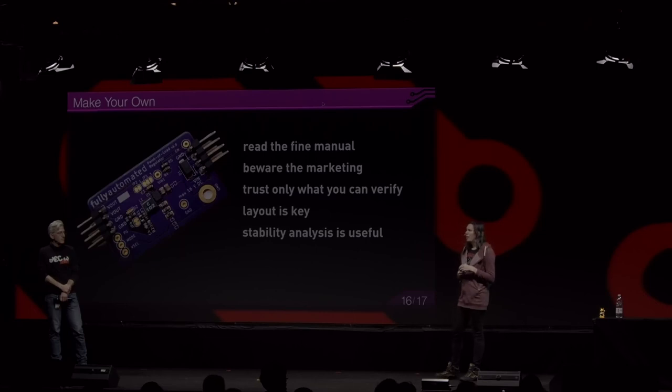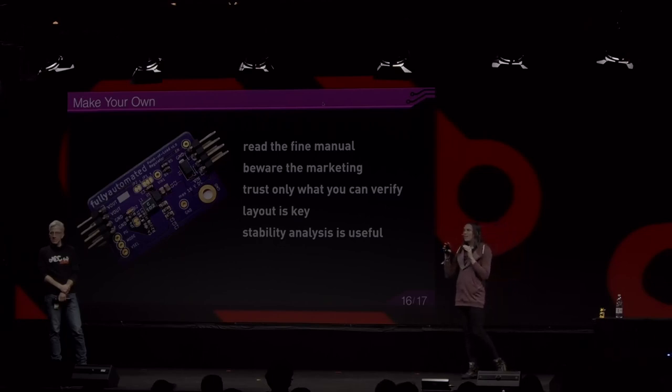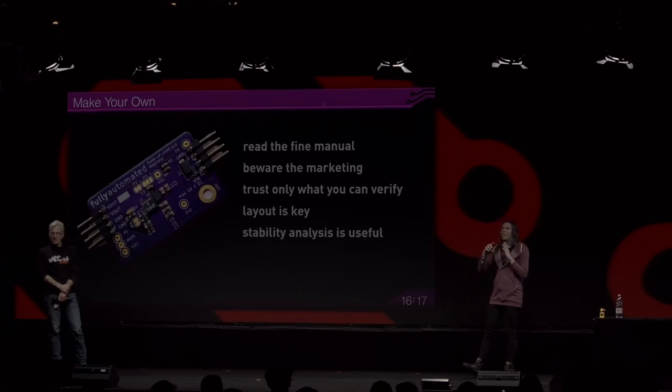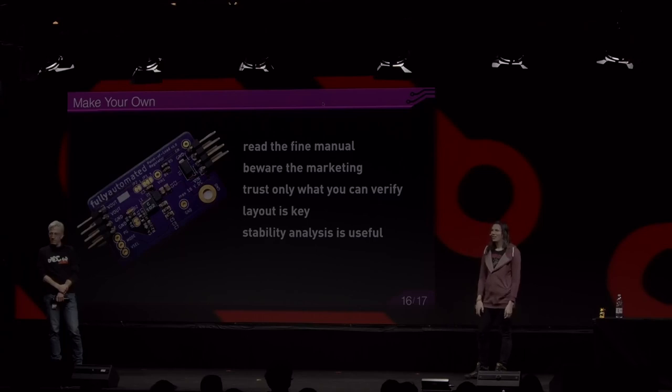For stability, that should not influence the stability of it. What I should have mentioned is stability analysis, because we have a control loop. The control loop takes the output and creates a control signal that influences the output. But this loop has a delay. And because of this delay, basically, you can make an oscillator of this. To avoid that, you can use a network analyzer and inject a signal into the converter, and then, you know, do the drill. Thank you.